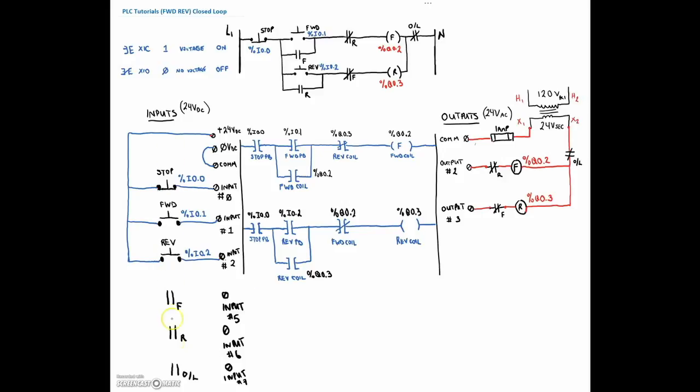I've sourced each of these - sourcing meaning that I've just provided a positive voltage to each of these. Positive voltage is coming from this terminal right here on my PLC. The PLC may have a 120-volt source, and when you put that 120 into the PLC, it has a rectifier circuit that provides you with 24 volts DC that you can use for your inputs. In this case, I'm doing a sourcing in that the positive is going to each of my switches and I'm switching the positive. The PLC already has a reference to the negative, so each of these individual contacts are going to go to their own separate inputs, and the only thing that will determine how these affect our outputs will be the PLC.